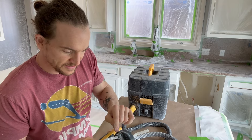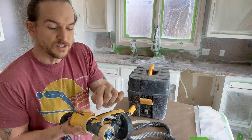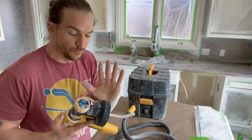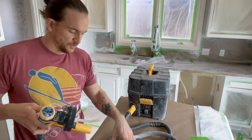Always open this up, clean it out, don't lose that little piece in there, and make sure it's clean. When my gun's not spraying right, I usually get frustrated, spend five minutes on it, and then realize — oh, the one-way valve — and check it, and that's usually the culprit. If you've got that little blue piece in there, you shouldn't be seeing paint get in here, but if you do it means that piece is missing or out of whack.